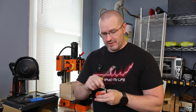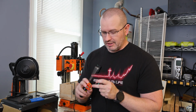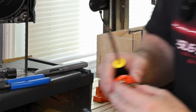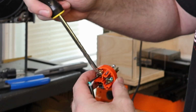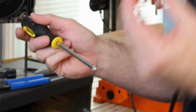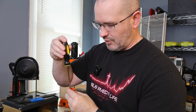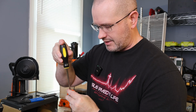So I'm going to start with the black wire, which is our power wire, and it goes to the gold lug. Put it in there, and like I said, it's okay to have enough showing that you can see, but you want to make sure that it's in there fully and that the insulation is not up underneath the lug here. Otherwise, that won't be a good seat. We won't get good connection, rather.